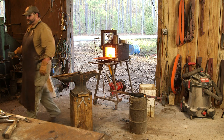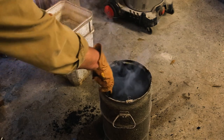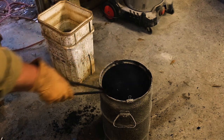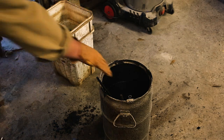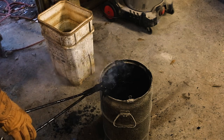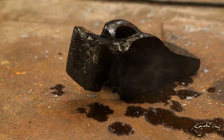Temperature is good. The thermometer I have is a very high-temperature one, so I can actually shoot the hammer in the forge when I'm hardening and read the temperature accurately. This makes everything go quickly. In a super production setting you'd have those hammers in a digital oven, but for what I'm doing it's just not necessary. For tempering, however, you do want to be very accurate — so this goes in my modified Paragon oven in the back, cooks for about an hour, then is dropped in water to be tempered. All right guys, thank you for watching — catch you in part two. Hope you're enjoying the new videos, y'all be good!